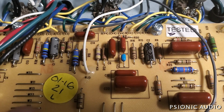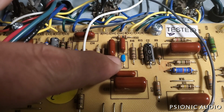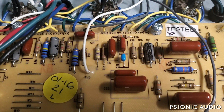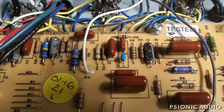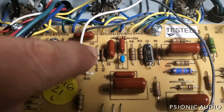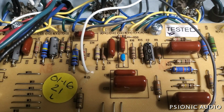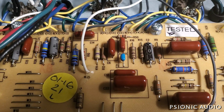All right, those are all changed out. My vendor did not have a little film cap of the right value and voltage and lead spacing. There's a lot of stuff that's out of stock these days. But that ceramic disc cap I have in there is a Murata, and it's a 1 kilovolt cap, and it will never ever fail in this amp. I love these for the LFOs in Fenders. Just really nice, long-term reliable caps. And that 470K is in place, and it's another 1/2 watt carbon film, and I like to keep all the tolerance bands on the same side.